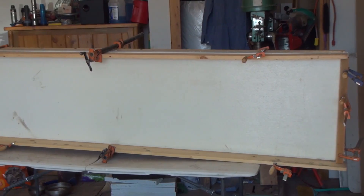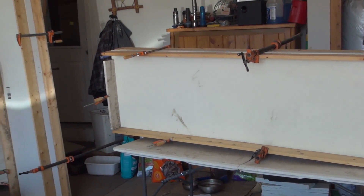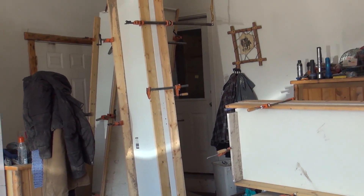One of the things I learned doing this is that the fiberglass sheeting is really wobbly. I assumed I'd be able to put mastic around the sides, put some screws in, and it would be fine — but what happened is that even the mastic would hump it up. So I had to get some clamps and put boards on to clamp it down, and then I think it's going to be fine.